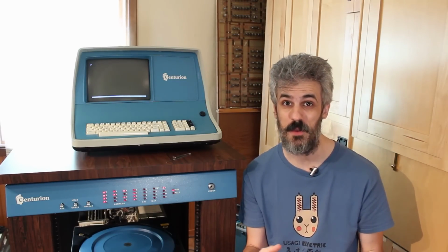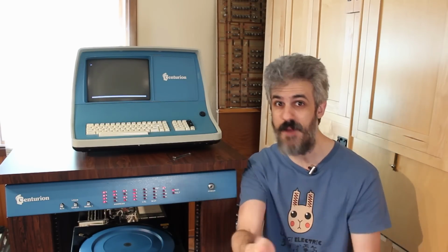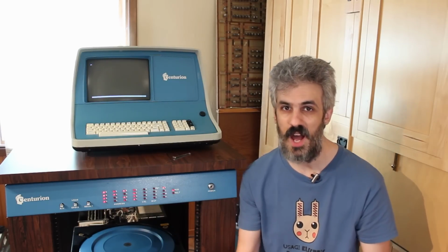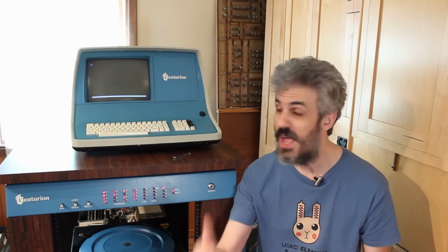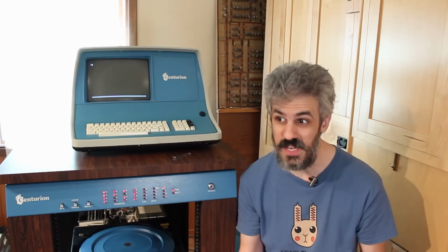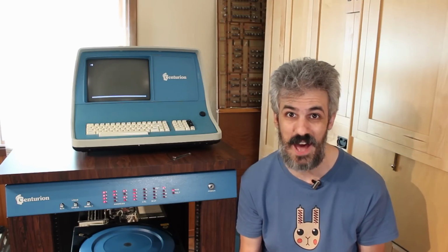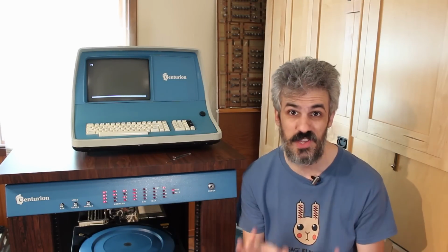So what I think was happening with that was that it was already misaligned, pretty much extremely so. And then whenever we spun it down, that metal on metal contact just pushed it even further. And now we've got it lined up, and Gavin's program was showing perfect reads on the fixed platter. So, I said I think we had a thermal issue on it. I think that thermal issue was actually the platter itself thermally expanding and pushing the heads out of alignment. But now it looks like it's perfect.